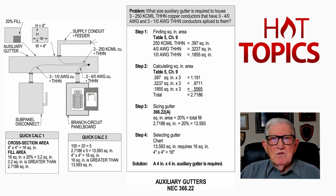And we're just saying this, you could have 30 control circuits or signaling circuits just for starting. Although it would be 60 conductors, you would only have 30 that were current carrying, so there'd be no derate, but you'd still be stuck to that 20% fill, see.